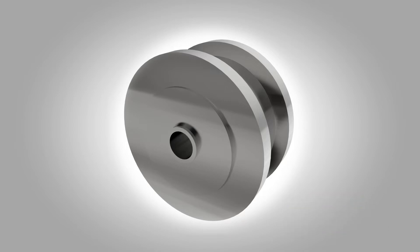When you're designing for a V-groove type application, your track is most likely going to stick up above the ground with the V, so you have to make sure there's not a trip hazard with that. We don't recommend going with V-grooves on both sides of your cart, because you'd have two Vs on each side and you'd have to lay that track almost perfectly parallel to each other to make sure that those wheels don't bind up.